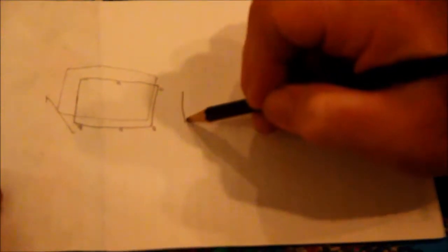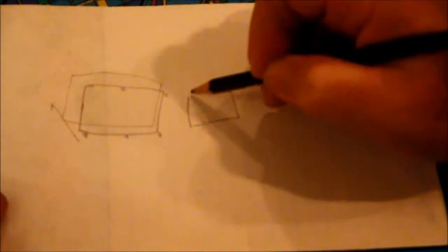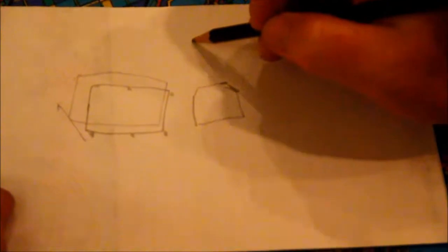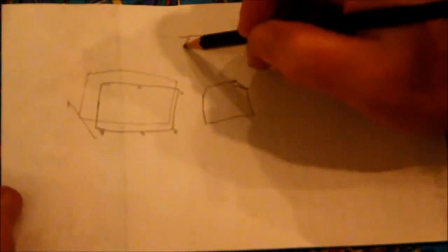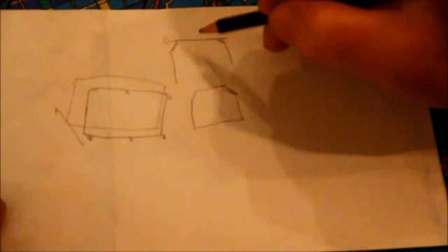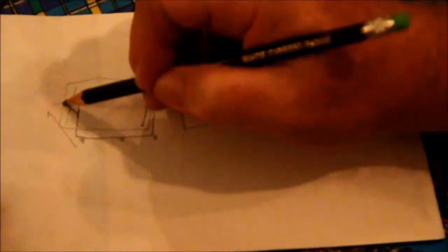For the sides, we figured the height and did a little 45-degree cut, making two of these — one on each end. That way the top had an area where you can get a clip under, and the sides were indented about two inches so you could get clips on the end. There was a piece of plywood left over, which we put upright right in the middle, screwed into place. This came about halfway up and gave the table a lot of rigidity so it can't fall over like a house of cards.